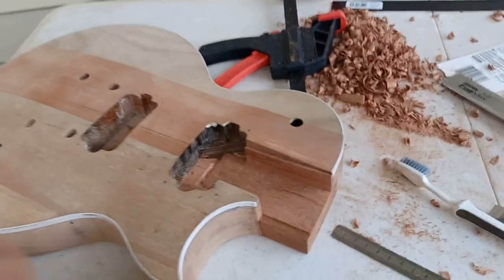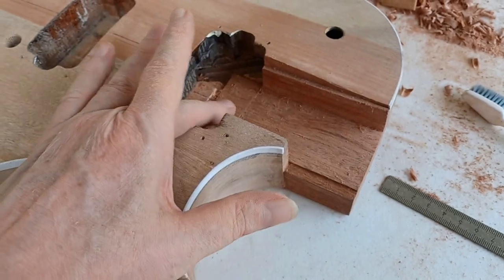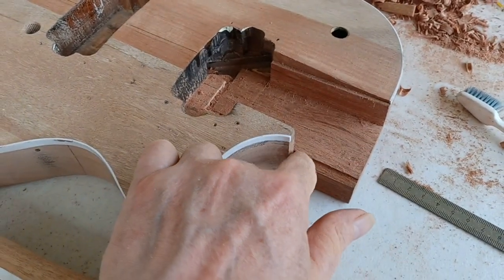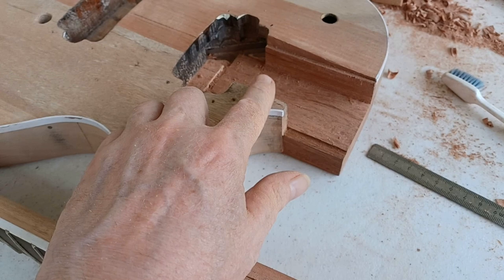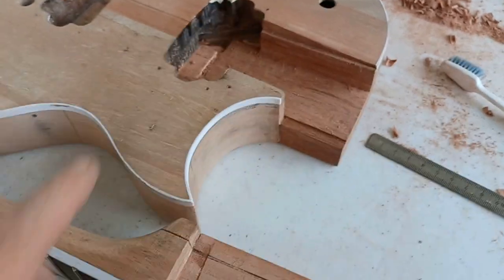Here's the first update of the evening. I've got this all dug down to where it's level to the bottom of the pickup cavity. I'm going to go down as far as that just to give me a little lip on the back here. That sets my fretboard height — 20 millimeters over the top of this.